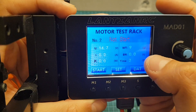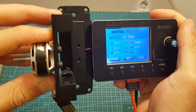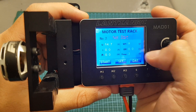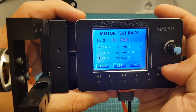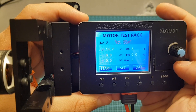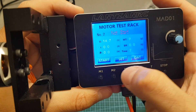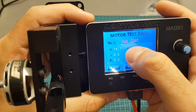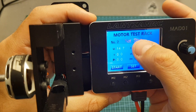Let's go over the display data. First we can see the weight in grams — pressing the motor thrust stand makes it go up, pulling it displays a negative value, and it can measure up to 10 kilograms. Then we have the efficiency value, which I'll explain later when analyzing data. There's also the time in seconds used for the motor auto testing interval, which you can set between two to five seconds. Finally, we have the battery voltage, the current in amps drawn from the battery, and the watt, which is simply calculated by multiplying volts by amps.